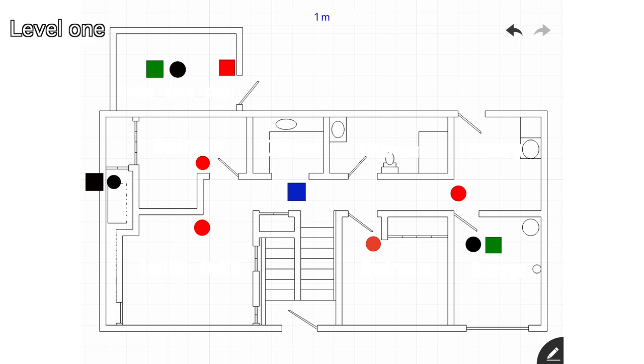Black circles are heat detectors, and black square is the fire alarm panel, which it will not be outside. That is just how it ended up on here because I ran out of room on this drawing of this floor plan. And then red square is pull station, but all three devices in that detached shed building, sort of detached, it's underneath the deck, but there's no entry or access directly from the house. You have to go outside. That will be wired at a later date. That won't be in this video.